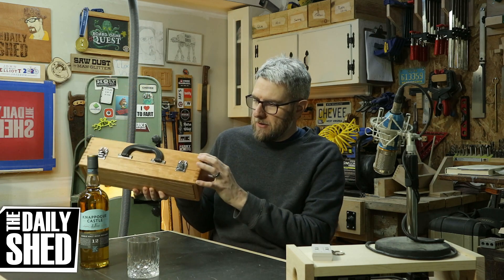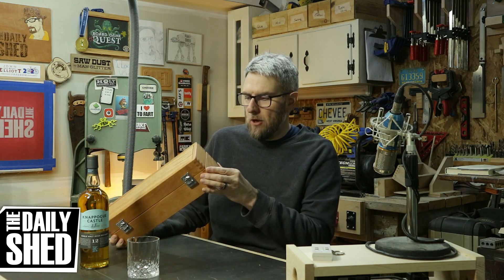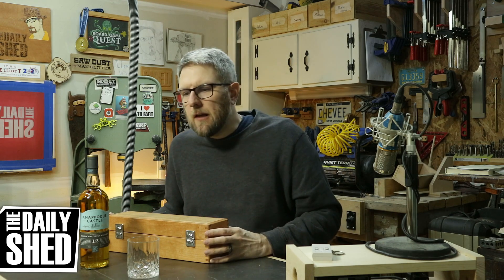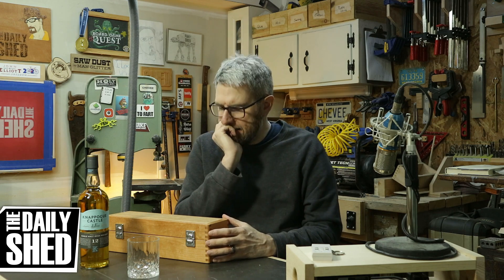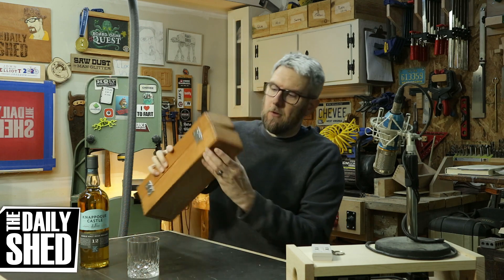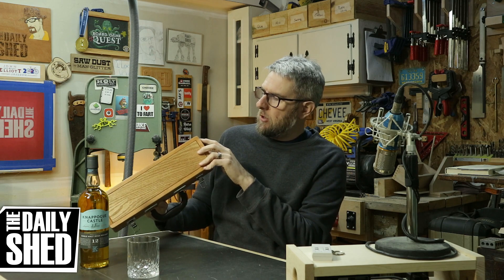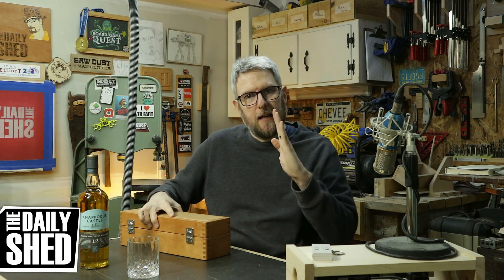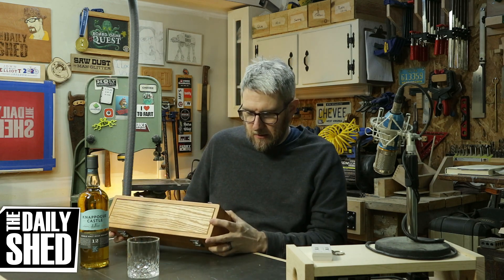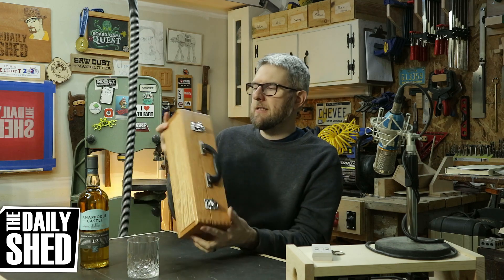It was a bit of a chore to make and my finger joints did not come out as nice as I was hoping. I made a jig — I think I showed it to you when I made it — and I tested it and it went great. The joints came out beautiful. On this one though, some of the joints have little gaps. It looks like maybe the saw blade got kind of canted in the middle of the process, so some of these finger joints almost look like they're wedge-shaped. It didn't close up all the way in some spots.